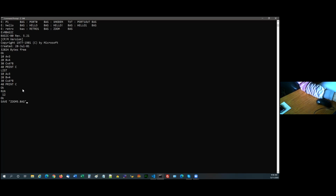Hey, Ray. Yep. You have a 64K map there for that instance of CPM, right? Yep. So you could run multiple instances of CPM and maybe have them converse over separate sets of pins, but is there any value in doing that, do you see? No, you'd be better off to run CPM 3, which is multitasking. But we didn't ever do that. You've got to do bank switching to have that run. But most people seem to be interested in CPM 2.2. I see. And we've got plenty of room for that, but we can always introduce bank switching, but it'll marginally slow things because you've got to play around with the addressing.